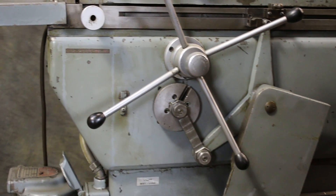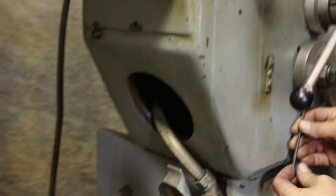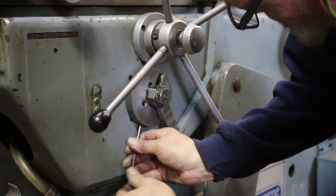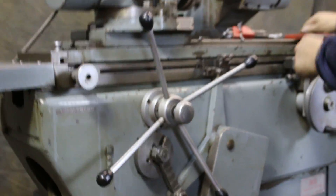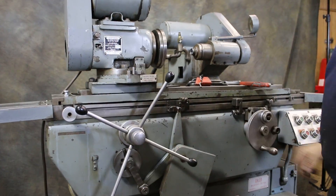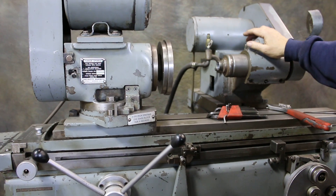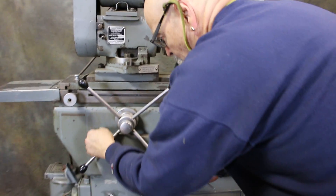We can make an adjustment — there's a spot here for an allen wrench, and there's a scale mounted right in here from zero to two. As I move this off-center — we'll just go a little bit right now — as I move that off-center from the zero mark, tighten it up again, you'll see that when we start this, we have this eccentric moving, which is now moving this. And when I lock this down, it's going to move our table. This could be used with your spindle to make a reciprocating, a fast little stroke. You can adjust the length of the stroke by how much of an eccentric you move off-center here. This would be put back over here to keep everything clean.